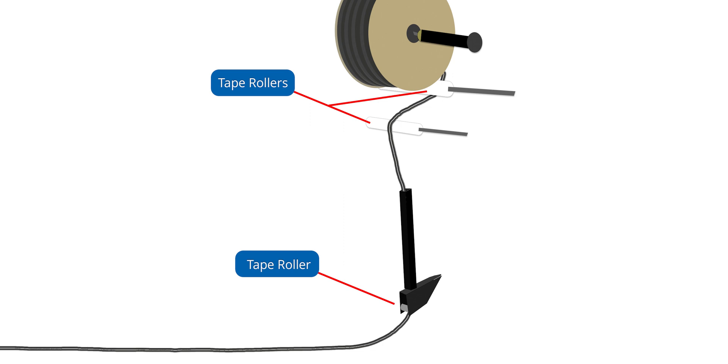There are a lot of ways to fix that. We have things called rollers — both top and bottom — which introduce the tape into the shank. Between the rollers at the top and at the bottom, it will not allow the tape to ever flip. As we lay our tape, we constantly dig to check. You'll always notice our P1 Ultra has stripes on it — stripes to let us know what's up and what's down.